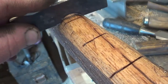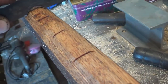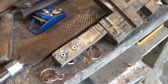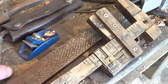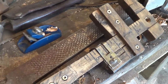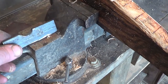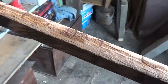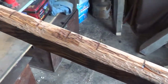I'm trying the guide out on the handle and I can see I've got a ways to go. For all the detailed work I'm going to use hand tools — spoke shave, draw knife, a little palm planer, farrier's rasp, caliper, and my guide. I have the axe handle turned sideways and I'm just going to take my time and try to make it as symmetrical as possible.